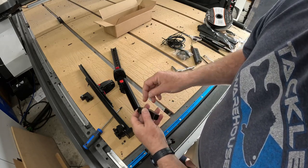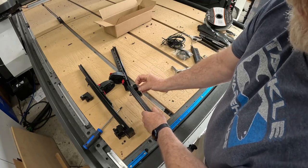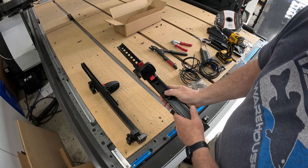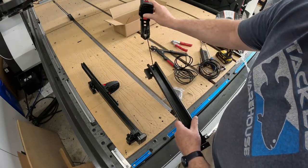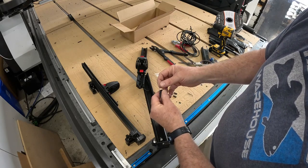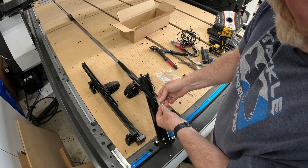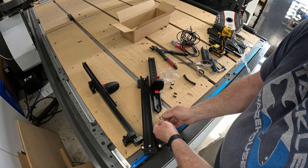Add your screw and add the washer in between the L-bracket and the slider — this gives a little more room for the wing nut. At this point, you can attach your cable and cable housing. Simply pull up your end, put one of your crimps on, take a small section of shrink tube, loop it through the eye, and back into the crimp. Get this as tight and as short as possible.